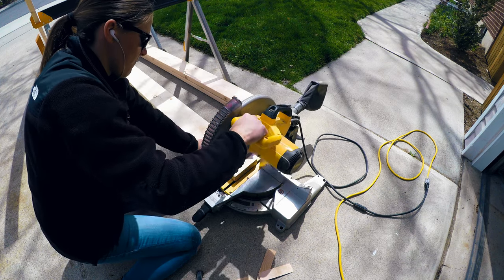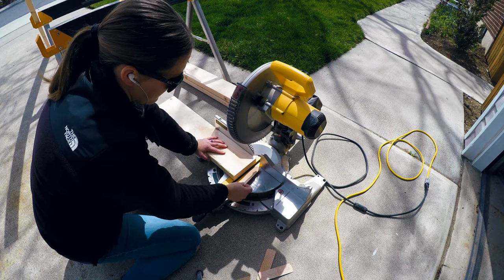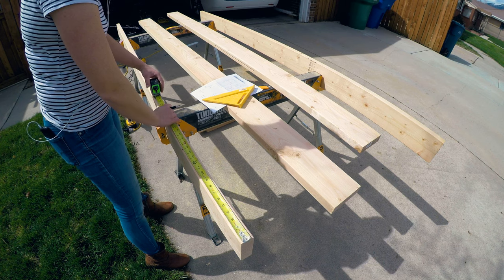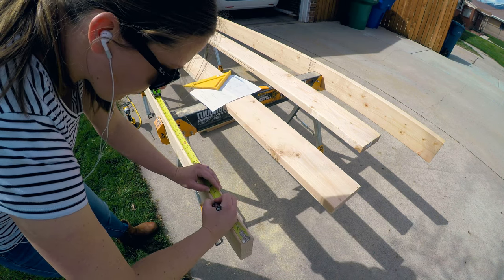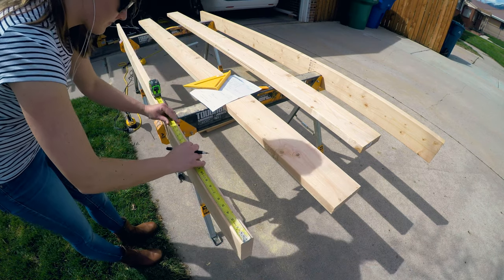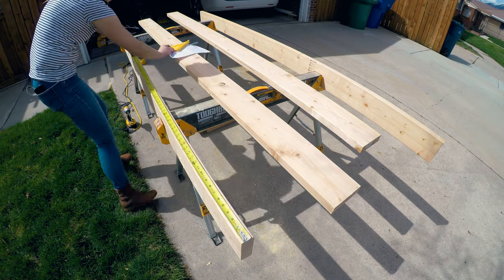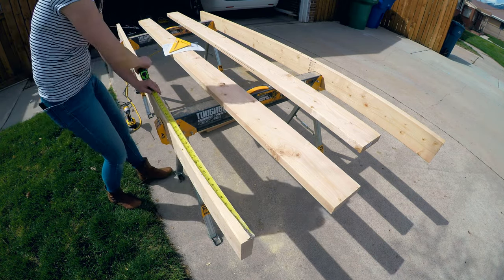Start by cutting 4 2x6s to the length of your door. The boards then need to be marked for where the dados will be placed. These dados are so that the glass and the shiplap can be inserted. You can find the exact measurements, or I do offer plans of these doors on my website. There is a link below.